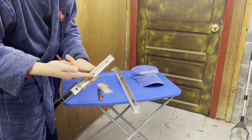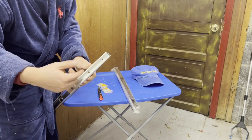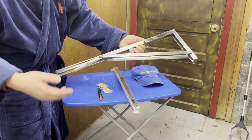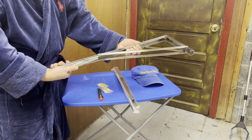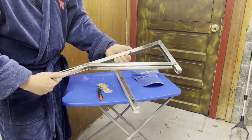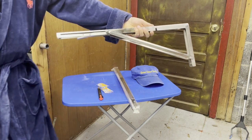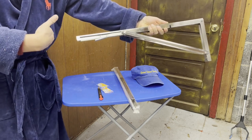The screw holes look like they fit a quarter-inch screw, which is good. If you want bigger, you'll need to drill it out, and you'll need a decent drill bit because the metal is pretty thick. A really cheap drill bit might get one hole done but not more than that. Now this is the one I picked out — the cheapest version that still has the release at the front of the hinge, and that's the reason I chose it.